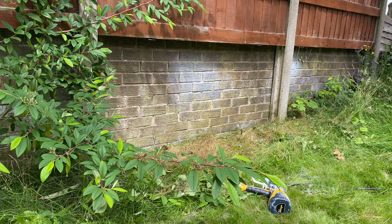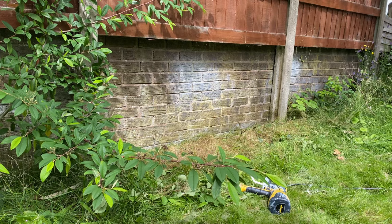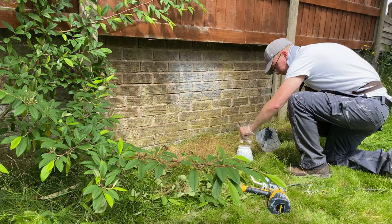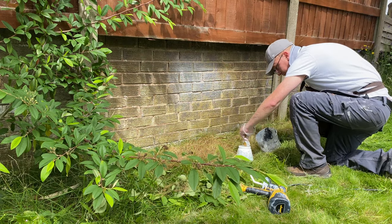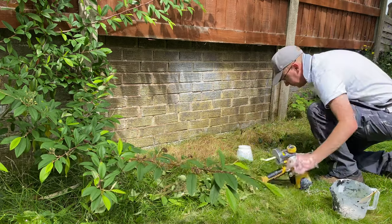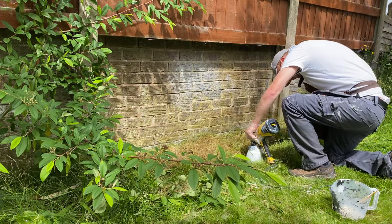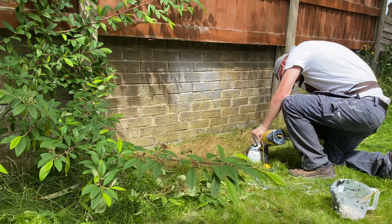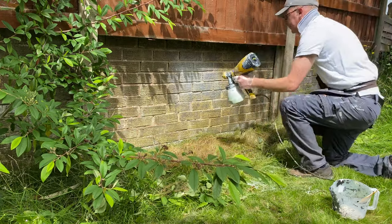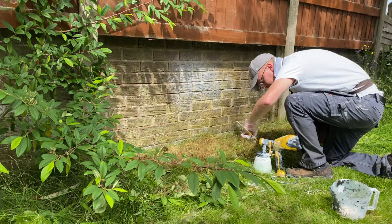As you can see, the gun was really struggling with it — there was no way it was coming through, with a very pitted sort of effect, and the paint wasn't getting through well at all. I then adjusted the mix ratio up to roughly 20% water to masonry paint, but there was still difficulty getting the spray gun to function correctly because the paint itself was still too thick.